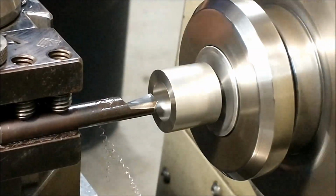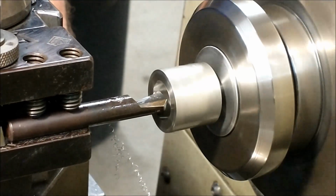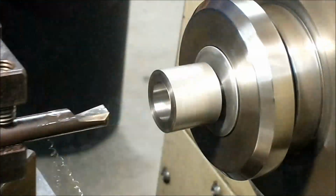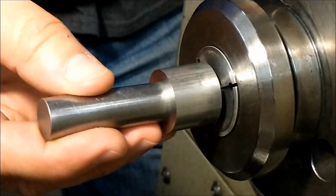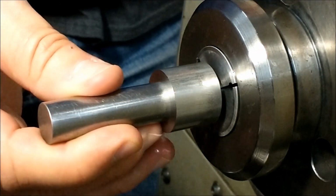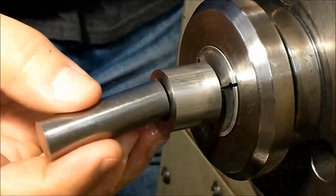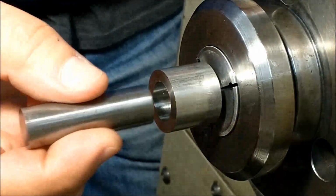This is a very light press fit, so I'm going for about a 1/2 thousandths press fit on the bearing. The bearing itself is 625, 5/8 imperial, and I want about 5/10 thousandths of an inch press fit. And that can be a thermal difference too, so check the temperature on this, make sure it's not too hot. If it's really hot, as it cools down, that press fit will get extremely tight, and that's not what you want.